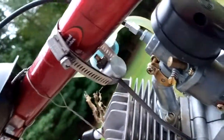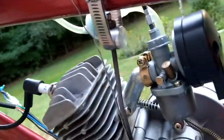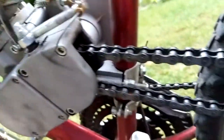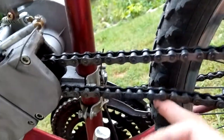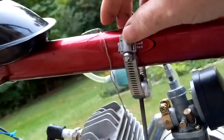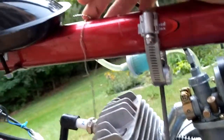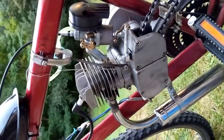Here it is with the cable clamp snugged down holding the motor so it can't torque back to the left, which is what it likes to attempt to do, and that will keep the motor at that position. It won't let it go anywhere, and it keeps the chain properly tensioned so it will run smoothly. I'll grab a pair of pliers and cut this temporary fix off of there, and it's all done and good to go.